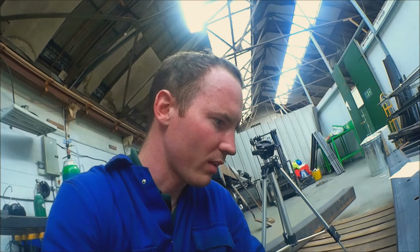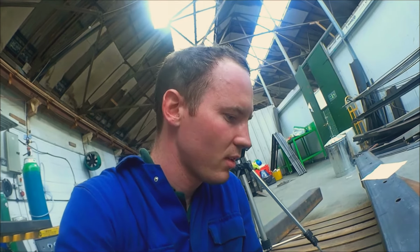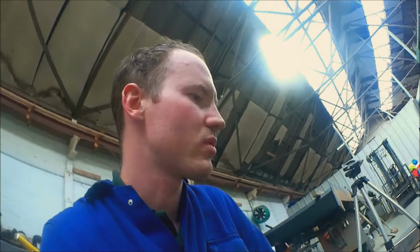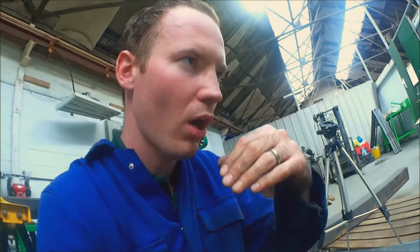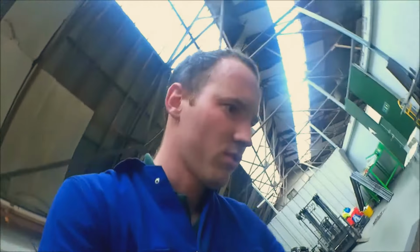This is the thing with welding, you get it all set right to start with, and then you add molten metal into there, and the metal shrinks and pulls everything out of alignment. So the best way to counteract it is either make things overcompensated for the movement, so when you weld it, it comes back, or just brace it as best you can and hope for the best.